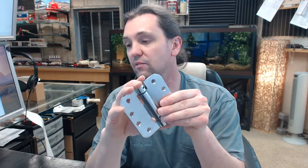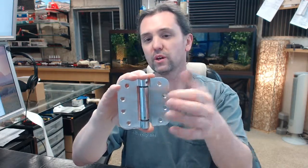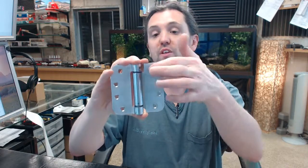Now, there is a link below this video called Template, which shows everything important dimensionally about the hinge that we've not covered, which is a lot. Not much of it is super important. Well, all of it's pretty important. First of all, the leaf thickness, 96 thousandths, that's really important to know. That's considered residential grade rather than commercial grade, typical for residential applications. It gives you a couple of other dimensions that are less critical, but if you're not sure if these screw holes will line up with your existing prep, that template will show you precisely where these are laid out, and you can verify that against what you're working with.